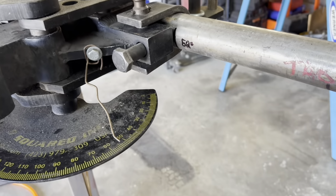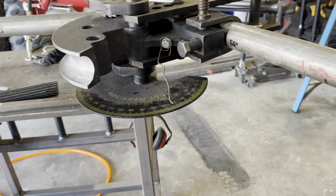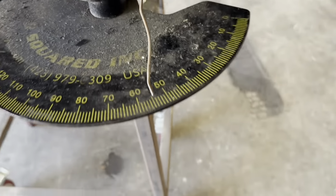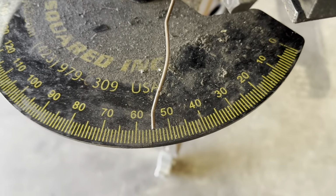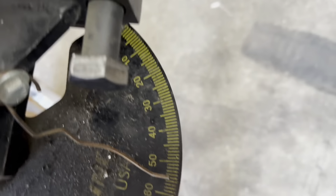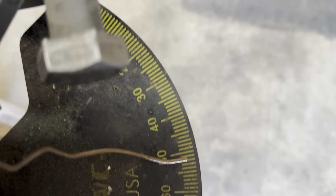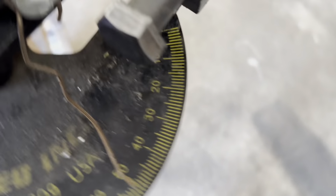Well, the concept you have to make sure you're considering, and you can never bend too little while it's still locked in, is spring back. What I typically see is somewhere between 2 and 3 degrees of spring back. And if you don't know what spring back is, I'm about to show you when I release the pressure off this. Boom. So there's your spring back.